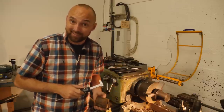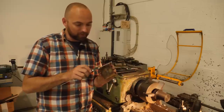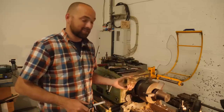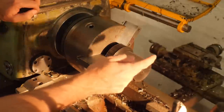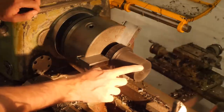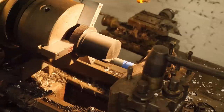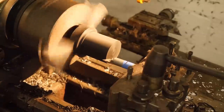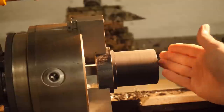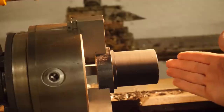Booyah! The new part is now within a hundredth of a millimeter of the old part, so that is certainly plenty accurate for this. Before I get to the tricky part — the inside hole — let's go ahead and put a little chamfer on this edge here just to bump up the spiffiness a little bit. Of course this doesn't matter when it comes to the function of the bushing, it's more just that it looks a little bit nicer.